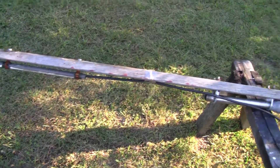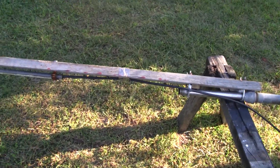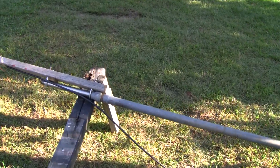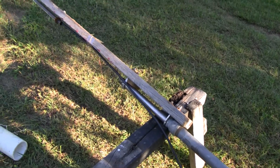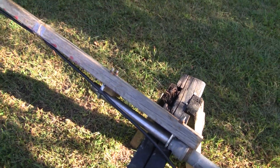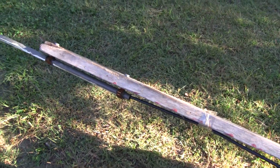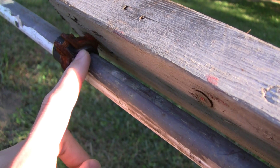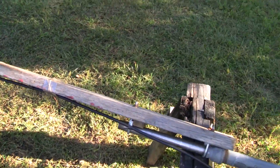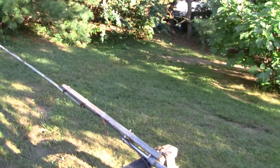One other thing — you'll notice I have this piece of wood here, about four feet long, but the actual separation between the antenna and the mast is only about two feet. The reason is that dipoles are very sensitive to things around them, particularly metal — and this mast is galvanized steel, about as metal as you get. I have U-bolts to hold it to the mast, and pipe hangers here. Just to be safe, I put some rubber in so the antenna is still independent of the mast. The board is insulated, but I added that rubber just to be sure.